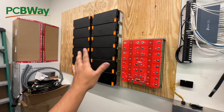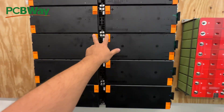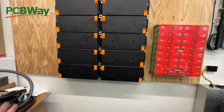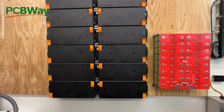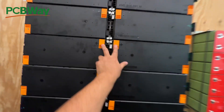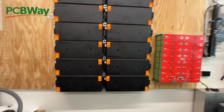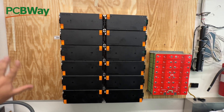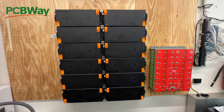There we go — 20 kilowatt hours. This little pack here can run 10 LV 6548 inverters at maximum. 20 kilowatt hours as opposed to 3.8 kilowatt hours in lithium iron phosphate. This is super compact and very narrow — you could put this in your garage and it wouldn't get in the way; a literal power wall. This is not done yet — I still need to run the bus bars and the BMS outside, since we replaced the original BMS with our own custom board. I'll save that for another video.